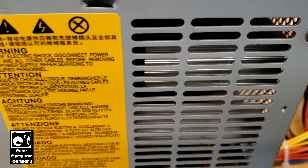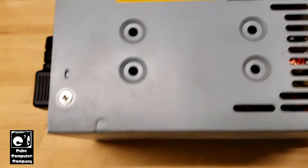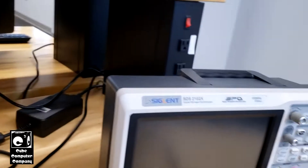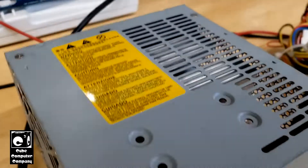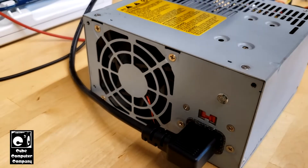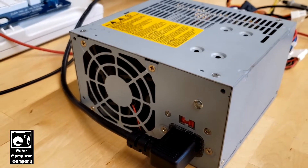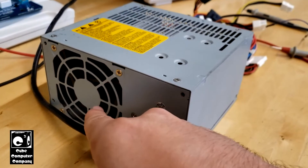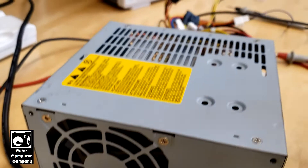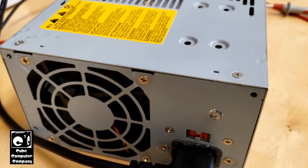You can plug power into it and the 5-volt standby does not start, so the whole thing doesn't work. The unit itself looks fine. It's nothing to do with the primary side, because when you plug in power, the primary caps do charge up — sometimes you'll see a brief flicker in the overhead lights because of the current those caps draw through the NTC inside. So the primary caps do charge up and the primary side has power. The 5-volt standby, however, does not have power.